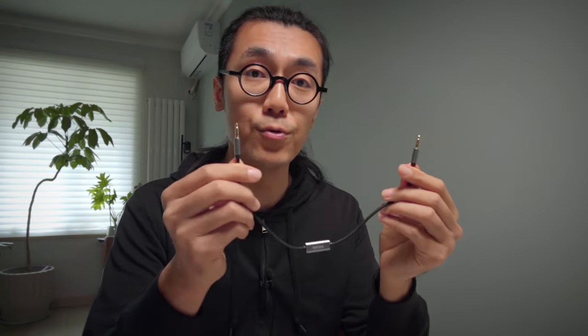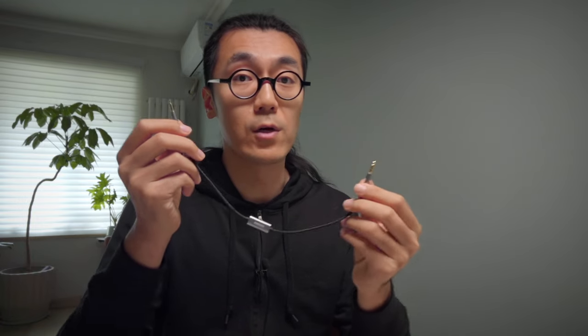And this cable is exactly doing the conversion work. It has two TRRS tips routing the audio signal out from one end to the microphone part in the other end, and also routing the output back into the microphone part. So no matter which direction you plug it, it will always work. I know using the microphone part for sampling will only give you mono samples, but to me it's fine because my guitar, my synth, my bass — they're all sending mono signals and I actually want them to be in mono.